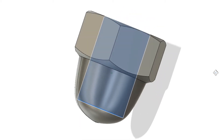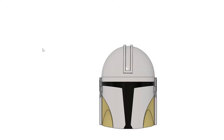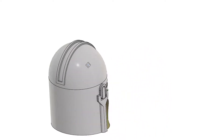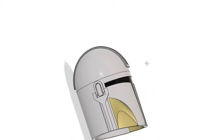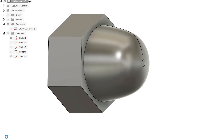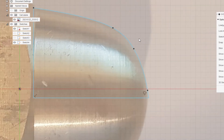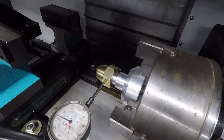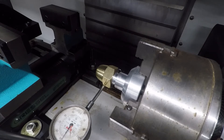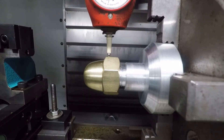The thread extended far into the nut, giving me not much material to work with. I got the model for the helmet from GrabCAD and used the most cylindrical-looking one I could find. I modeled the acorn nut as close to the original as possible and traced the round part from a photo. Then it was time to set a zero for my A axis — for Y I averaged two sides, and for X I used the tip of the acorn nut as zero.